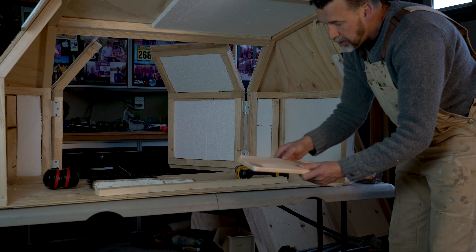It's actually turned out to be a very thick door, with two hinges that seem pretty sturdy. Basically you have a 2x2 frame with styrofoam insulation in between, sandwiched between a piece of plywood on the outside and cedar fence board on the inside. The whole camper extension is going to be this same setup — plywood, styrofoam insulation, and then cedar on the inside. So when it's all said and done I think it's going to be fairly well insulated, nice and warm in the winter, and will keep out the heat in the summer.